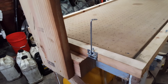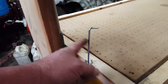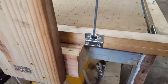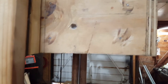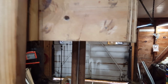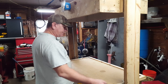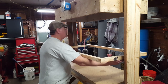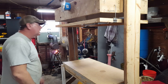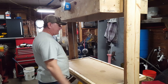All right, this is how I decided to do the hangers for the frame. These were in the metal scrap pile — I don't know what they are, but see, you don't throw stuff away. I found them in the scrap pile, welded them to a hinge, screwed the hinge to the frame, and just drilled a hole up here in the top. Raise it up, hook it in the hole, heat it up, when it's done unhook it and drop it down. Pretty simple. Let me give a demonstration — I put a little oil on these pieces of pipe and it helped out quite a bit. You raise it up, hook it in the hole, let it hang, turn the switches on, it's hot, turn them off, grab them, drop it down, stomp on the pedal — there you go.